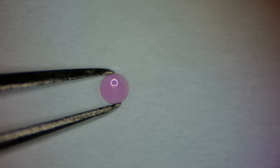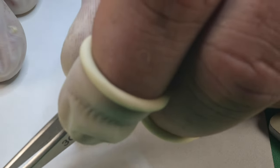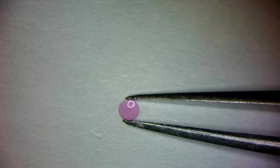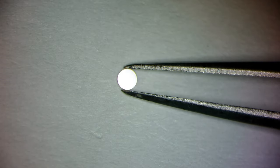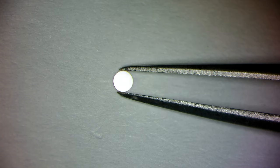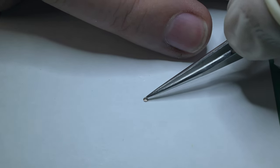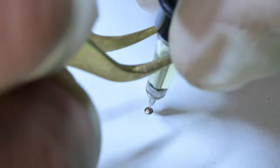To clean these, I put them in One-Dip for about 30 seconds to a minute, then I'll put them face-down on a sticky note — you can use watchmaker's paper or whatever — and just buff the flat side of that crystal against that paper with a padded sanding stick. Just note that the jewel can move around on you a little bit. After that it goes back into One-Dip for about 30 seconds just to get anything off that may have stuck on from the paper. That technique seems to work pretty well; every once in a while you get some stubborn dirt that you do have to scrub with pegwood, but that generally works well.